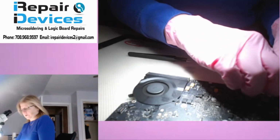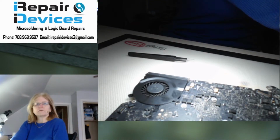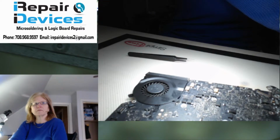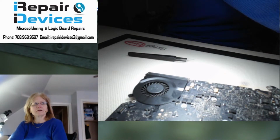All right. So now let's just unplug this. Now I'm going to pull up the schematic here. This was my PP3V3 line, and this was the capacitor that was missing. So this up here. So this guy was missing. And these lines indicate where else that this component ties into. So that's resolved.